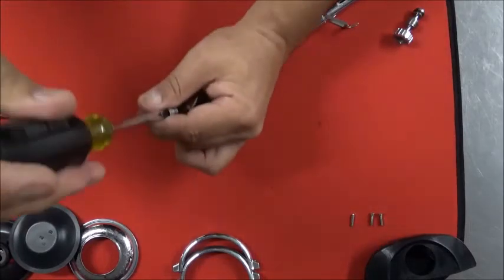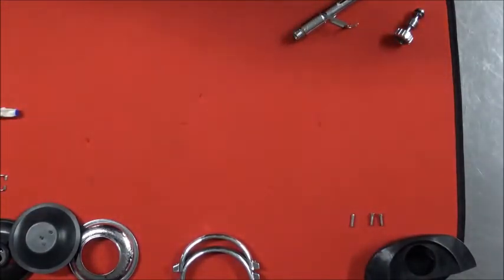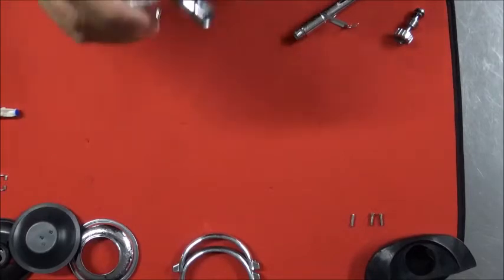And go ahead and turn it all the way in. I'm going to pull this back against me so I can look at it straight. Screw your Volcano Orifice all the way down till it seats, and you'll feel it securely stop there. Then back it out about 2 turns. That's not that important at this point, but just give it a couple of turns backwards.